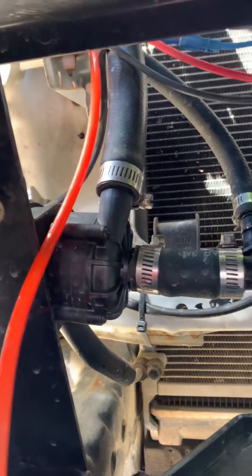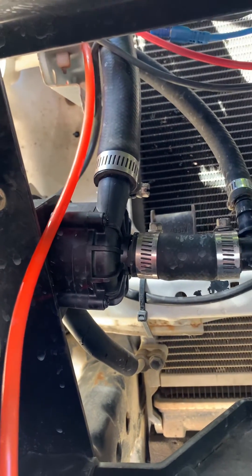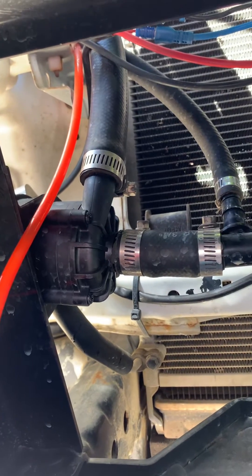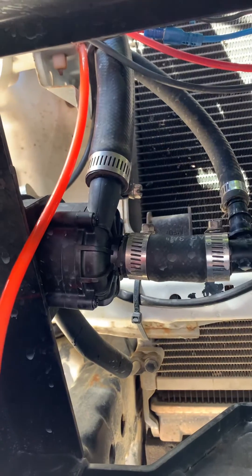The pump should sound like this one. But if it's buzzy and changing pitch, it means the pump is still not properly primed and there's air in the system. You've got to keep going until you get the pump running perfectly smooth like that.